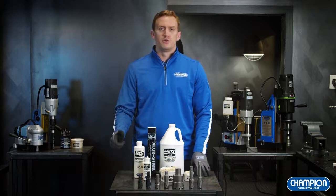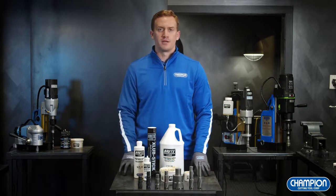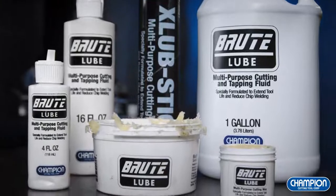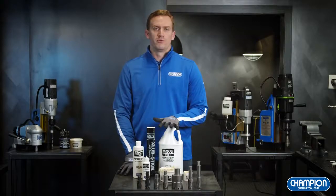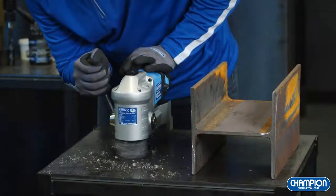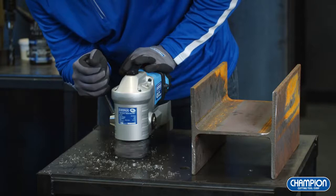Along with that, we have 1, 2, 3, and 4 inch cutting depths. Throughout today's demo, I've made sure to use our Brut Lube products. The benefit of using our Brut Lube is it enhances the heat resistance of your annular cutter. Because of that, you'll experience faster cutting, longer tool life, and smooth burr-free holes every time.